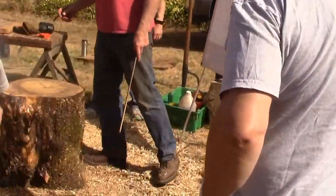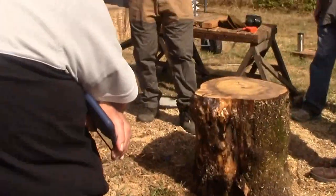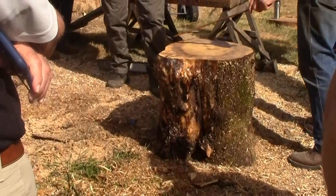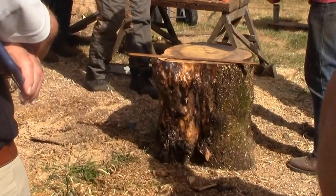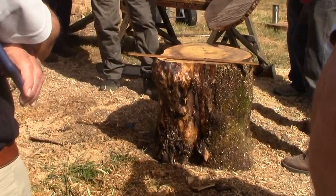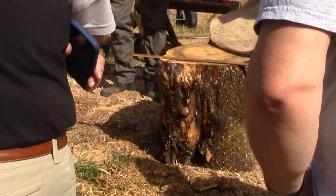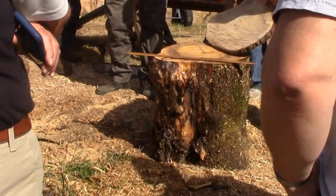When you're trying to get rid of the cracks on the end, and you're investigating where they end, how much do you take off each cut until you find it? Well, you take it off till you get down to this good wood here. You can see the difference. This is why I put water on it. You can't read this grain, really.